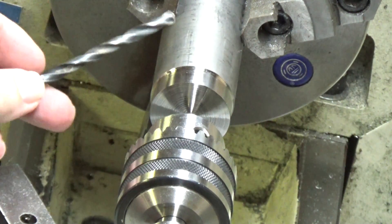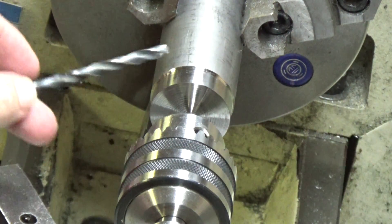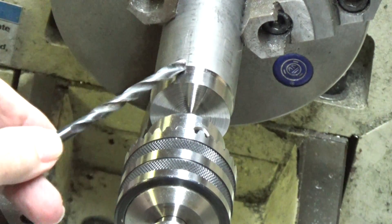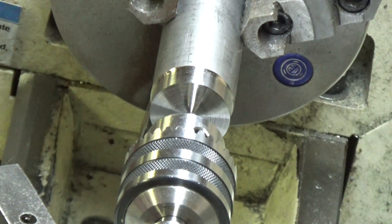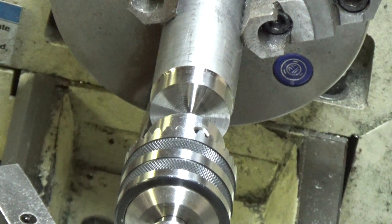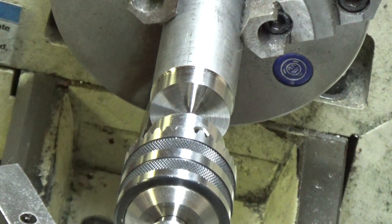Alright, back with this piece of 1.57 grade 5 titanium. The other end cap is the exit end cap and it needs to be drilled out to 3/8ths, or 0.375. I'll be doing a little experiment running the lathe really slow. Yesterday I was running it between 300 and 450 RPMs. I'll be using speeds of 190, 115, and 70. We'll see if slowing it down makes the difference.